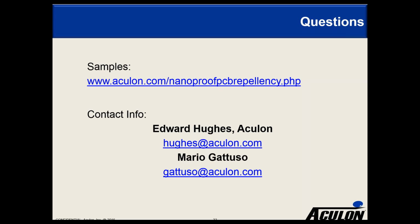And then one final question that's come in, unless anything further comes through, is asking what type of PCB handling is recommended or allowed after coating with 3.5 or 4.0? Typically, you just want to hold it in an area that's not something you're trying to protect. Usually there are plenty of parts on the board or the edge of the board where you can handle it and get it onto the next step of manufacturing without disturbing, say, the leads off an IC or where the power supply is coming in. You just don't want to handle it in the areas you're trying to protect. And that's because it still can deform, right? It's because it's deformable. We have people doing this manually, and obviously it's going to be a piece of equipment you can program to be very careful with it, but we have people doing this literally with their hands, and they're getting good results.